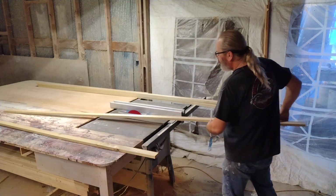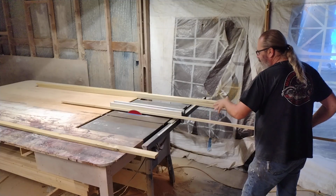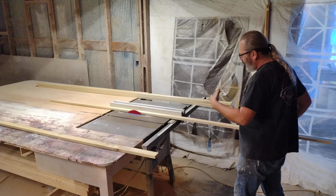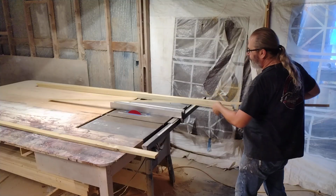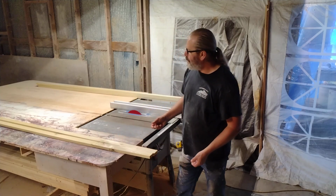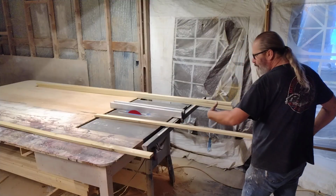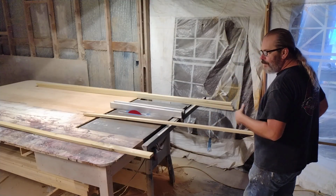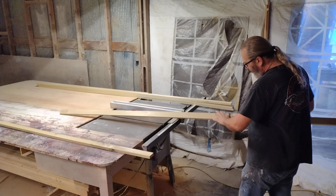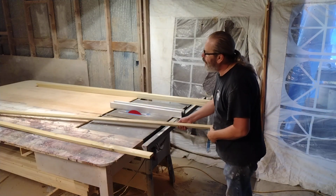Now, if you're cutting lumber and you get into a twist or something in the middle, on this saw, it don't even bother me. But you get onto one with more horsepower, and it starts to twist, you better get that off that blade, because it can happen in a heartbeat. It'll grab a hold and throw it back at you. And usually you're standing back where I was, running it, so you don't have to worry about the board hitting you. The big thing you have to worry about is it coming back hard enough that the edges cut your hands, or if there's a big splinter, it'll throw it back hard enough to drive it through your hand.